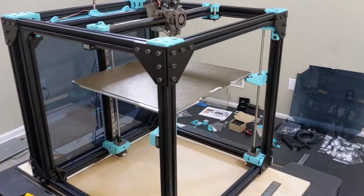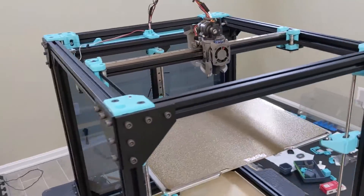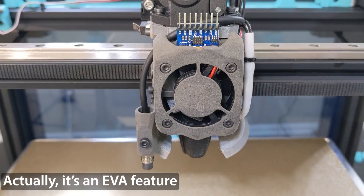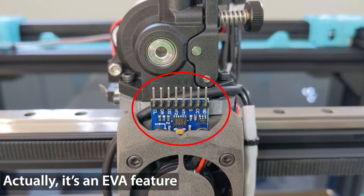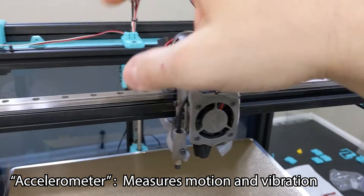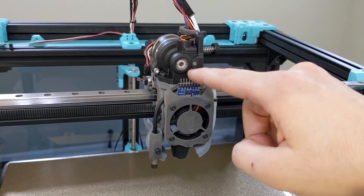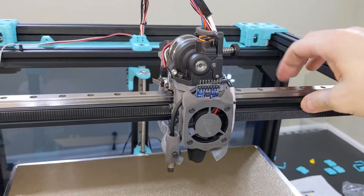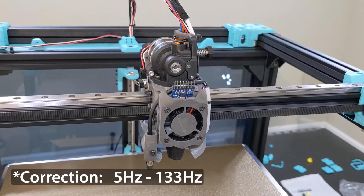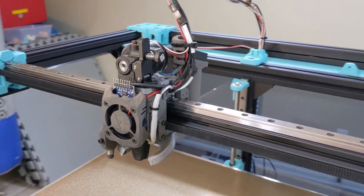This is after the completion of everything except for the wiring and the enclosure. I'm done - I think it was 25 hours to get to this point and most of it was this EVA assembly. One of the cool things about the RatRig design is that it's got this little circuit board right on top that looks like a fro on a rat's head. This is an accelerometer. When this thing is moving fast and flying around, it can cause vibrations, and those vibrations can transfer into poor print quality. You can run a calibration routine where it will jiggle the motor in the X and Y direction at all different frequencies from 1 to 500 hertz and measure resonance.